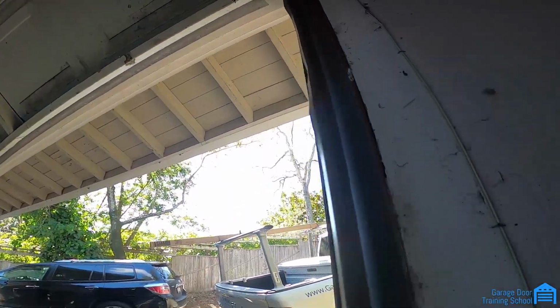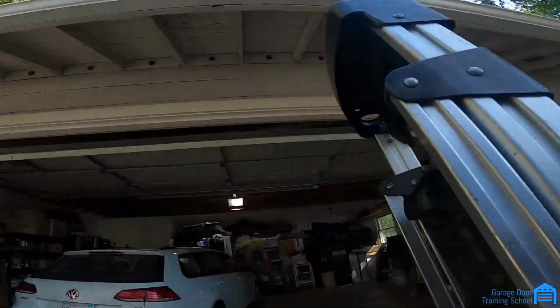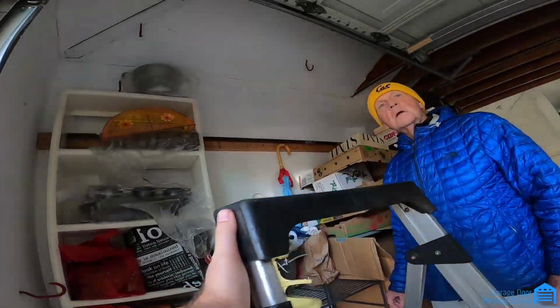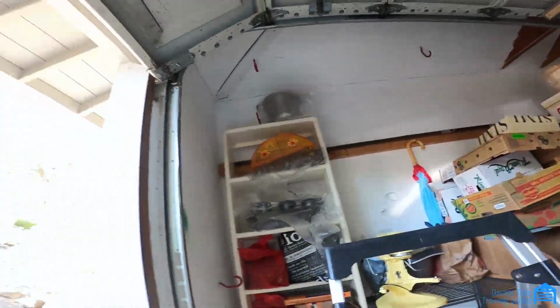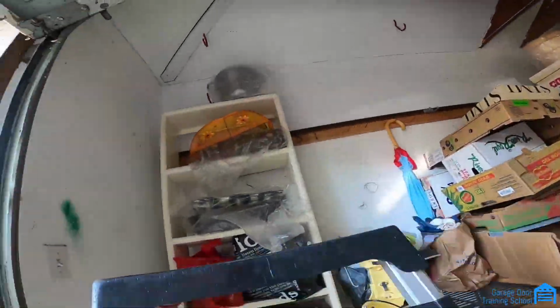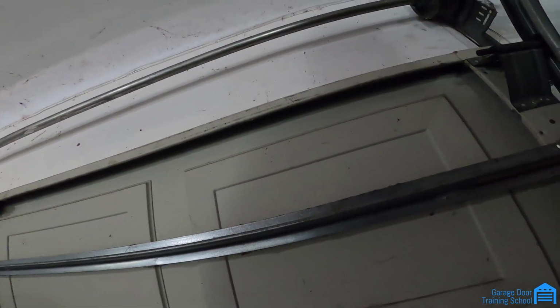Got it. So the drum up in there, the top of the door goes up and hits it. But that's all where it was when I got here. I didn't touch any of that. Yeah. But the only thing is, sometimes, like right now, the door goes up easy, so it might not have to push it hard. So the only thing I can really do is adjust this top fixture here so it sits away a little from the door, so it'll miss the drum. It doesn't do it going down, only going up, but it's pulling the panel up. This part right here hits right against here. I see. But I didn't touch these. So I could just loosen the top fixture and let it sit in a little bit. That way it misses the drum.